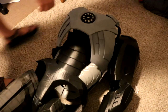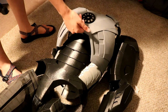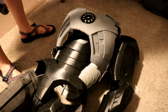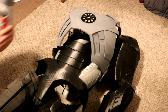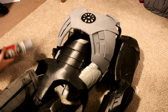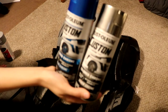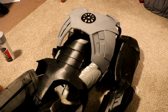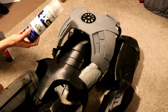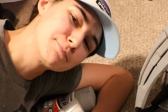Since I need motivation to see what this is going to look like when it's done, I already sanded this but I'm going to polish it up some more just to make it super clean. The plan is to use all Rust-Oleum paints. We're going to use filler primer just on top of the primer I already used, and these are the two colors I'm going to use. They're both called colored chrome custom colors, so they're automotive paints and should hopefully give a nice finish. Then we're going to throw a clear coat on top of it. Hopefully it looks pretty!